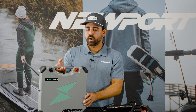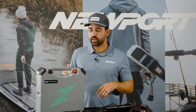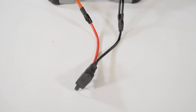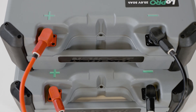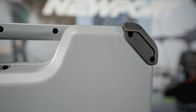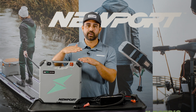In the event that you are running two batteries in parallel or series to expand your power — for example, if you wanted 200 amp hours of 12 volt power — you would use our parallel wiring kit to connect both 12 volt batteries together to get a 12 volt 200 amp hour system. There's an indentation or recess on the bottom side of the TPR corner that allows the batteries to nest together securely without sliding around. If the bottom battery has the bolt facing up, you want the top battery also with the bolt facing up.